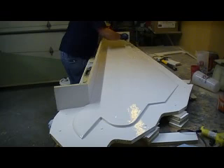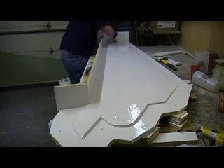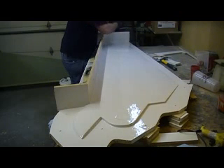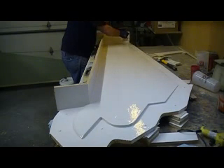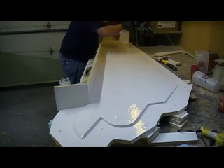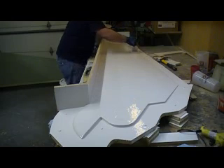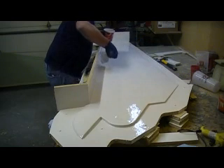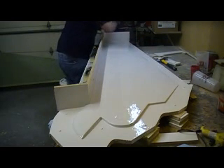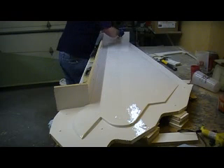You got to be careful with these chemical materials. What I'm going to do, I'm going to try to keep from putting a third coat on there. This is coat number two. I'm going to mix me up a little extra after I get this all spread. I'm going to let it set in the cup until it starts thickening up just a little bit, because this epoxy will start thickening up before it goes off. Then I'm going to put one more coat on my sides, because a fair amount of that is running off.